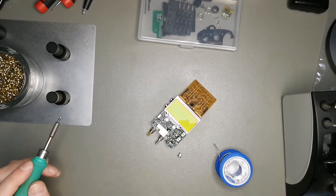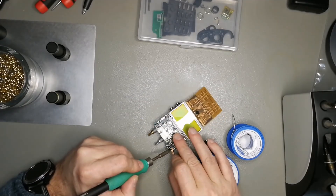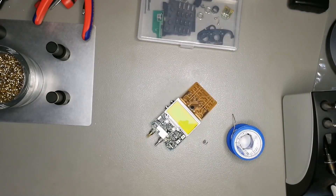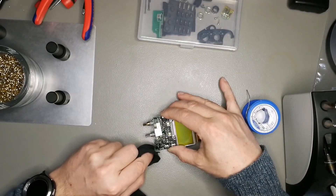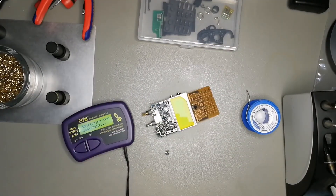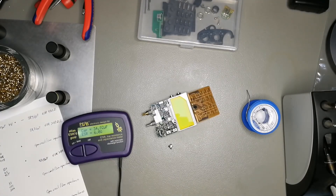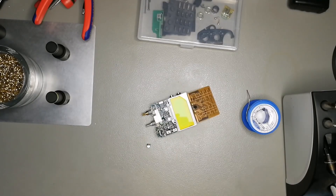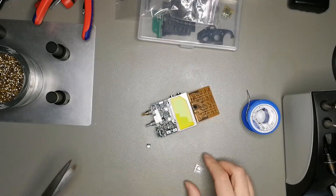So I just do this refurbishment right on my bench on my electrostatic mat. I didn't wear my electrostatic wrist band, which was also a mistake. As you can see, I already got the first capacitor out using two soldering irons — one in the left hand, one in the right hand — and got it out and measured the ESR.